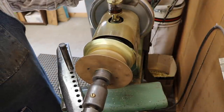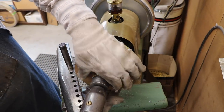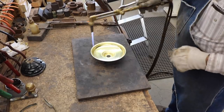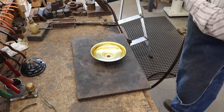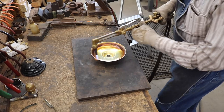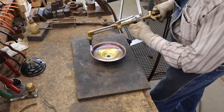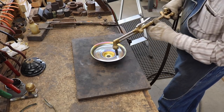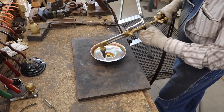The brass is starting to harden and won't spin well, so I'm going to have to take it off and anneal it before I can go any further. By heating the brass to a dull red and allowing it to air cool, it will soften it to where I can work it again. I stop the heating at various stages in the process in order to allow the heat to equalize through the piece — it serves to lessen the distortion and warping of the piece.